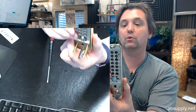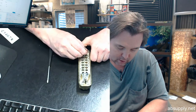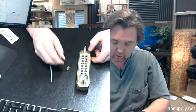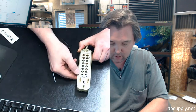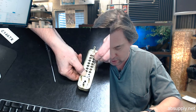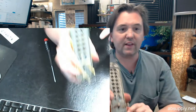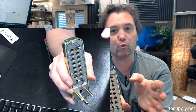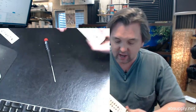Okay, so what I'll do is I'm going to restore this back to the original combination by flipping out my neutral, my blue, back to the 2, and my identified red back to the 1. Push my clear so I can get them seated down properly. All of them, actually. And it's locked. And that's how you do that. Basically, switch the red for the blue, record which ones are red. That's your combination. The notches have to be towards the outside of the housing.